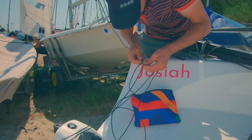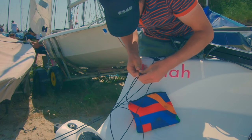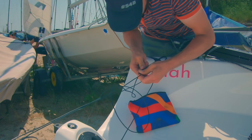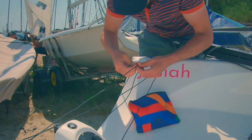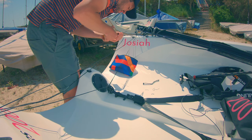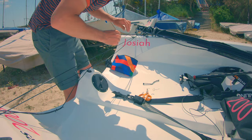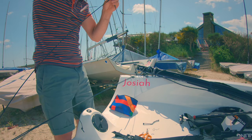If you get this wrong, your strops will always be off to one side and it'll be a nightmare, so definitely put a needle through to keep them together. Then with a fid, open up the port strop, go down it a good way — probably 10 inches or so — and take the starboard strop, which has gone across the boat and back on itself, splicing it inside the port strop. Tighten it up until they are matching at the needle. If you're uncertain, check that your mainsheet block is centred. Once you're sure the strops are equal length, start to finish off the splice where the two strops come together.